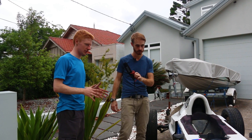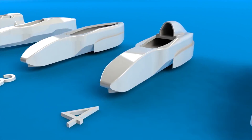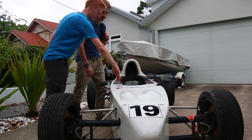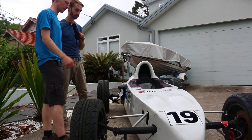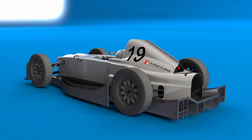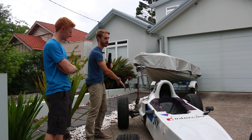So the bodywork — initially I had a general idea of aerodynamics so I had a few details. It didn't look too different to this, but initially the front was straight instead of the long curve that it's got now. It was straight and then it sort of curved out and went straight along the side of the car. After Carl got involved, he changed it to this long, nice curve. So basically what we did was we smoothed off this whole area here, removed a step that was kicking the airflow out that was causing big problems for us downstream.